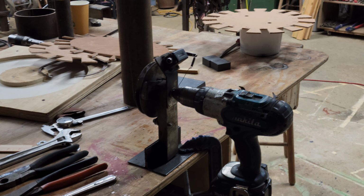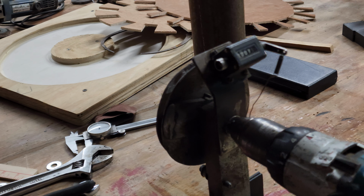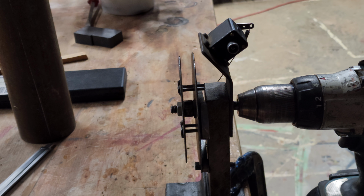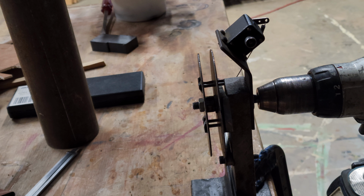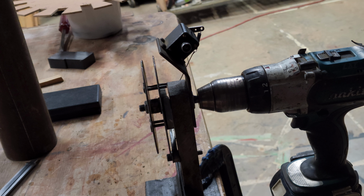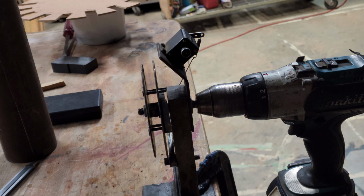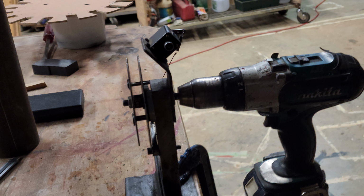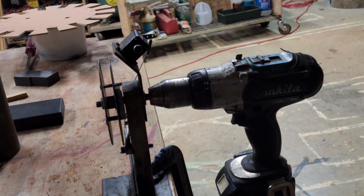This is the coil winding machine, and this is the one I made that it's got a counter on it and fits a drill. The coils are 1/2 inch thick. For the bigger machine, we'll go wider. The mold I've got is 5/8 thick, although I wouldn't mind going 3/4. With some testing I've done, it seems like a 3/4 inch thick coil will get us the best bang for the buck out of the flux available. But we'll put it together and put a test coil in there and see how we come out.